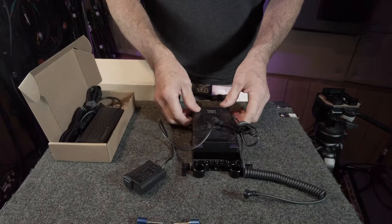We found a small knob open on both ends, a metric allen screw of the same diameter as the one on the matte box, a spacer, and a set nut to hold everything together. For about six dollars in total parts, we've created a knob long enough to extend past the matte box — you can see the assembled version on the right. We then remove the original matte box bolt and replace it with our pre-built knob. The top flag assembles easily, quickly secures with the thumb screws, and now we have a completely adjustable top flag for our matte box.